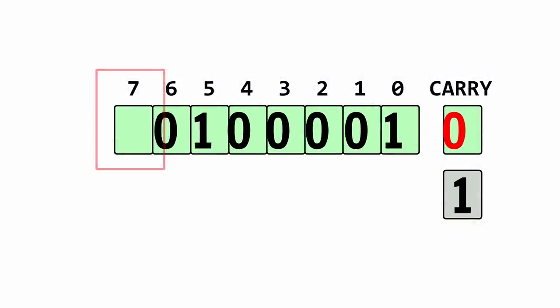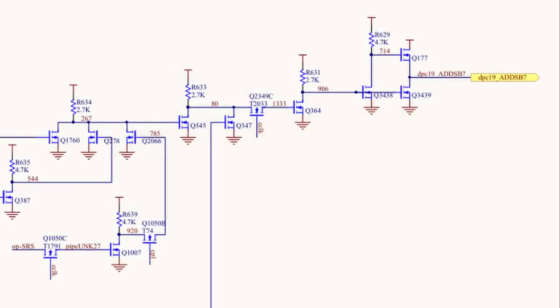This is literally one of the most basic functions of a rotate-right, and every logic designer knows this. If the 6502 truly had a rotate-right bug, I'd expect to see this circuit on the chip in some form. But instead, we see nothing. Therefore, the 1975 Revision A of the 6502 has no rotate-right instruction. It doesn't have the circuitry to implement it. It's not a bug — it's a missing feature.